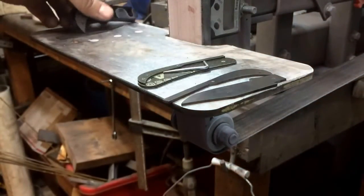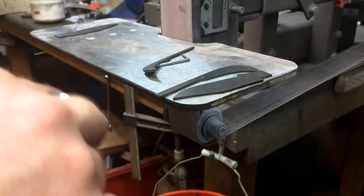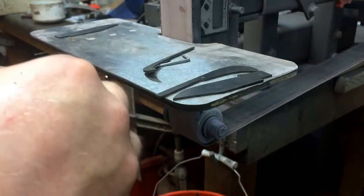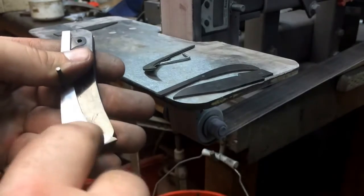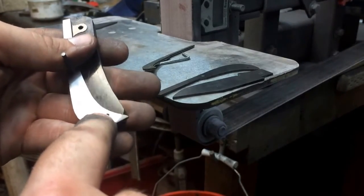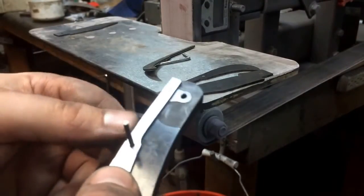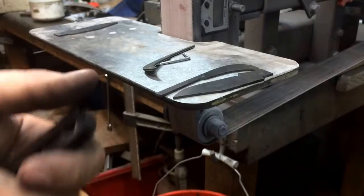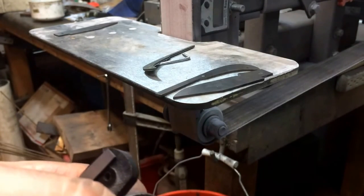What we're going to do now is go ahead and grab our template again, overlay it, get our center hole down here, make sure we're lining up, and line it up with the hole we've already drilled so that everything's going to fit together. Once that's done, we can actually take the springs and draw the temper back a little bit more with a hand torch. So I'm going to get set up on the drill press, and after that we'll temper our springs for the final time.